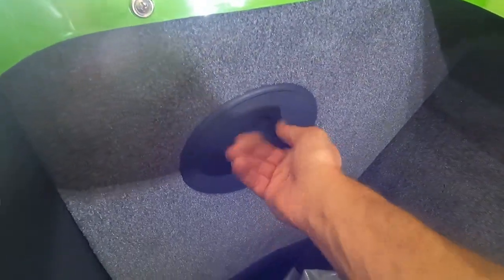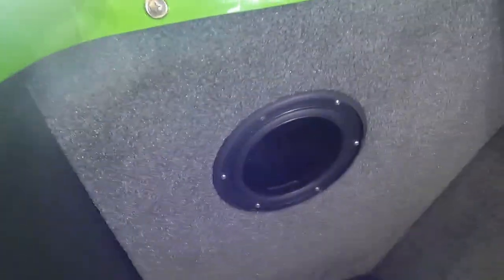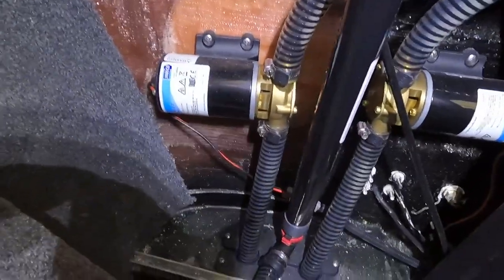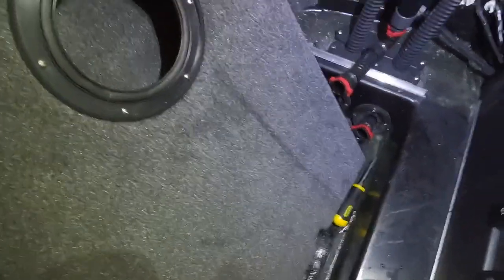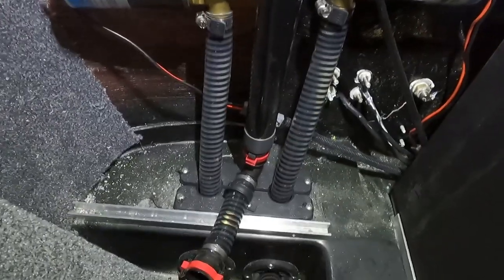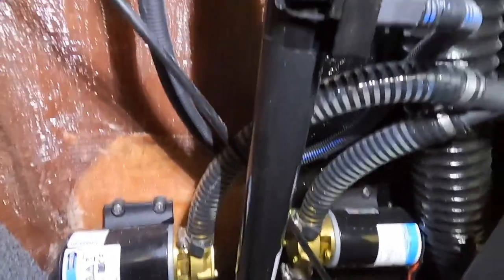They've got overflow vent sensors in these lockers. And that is what is inside right here, that's connected to that vent tube. Here's the other side. I've taken off this rear panel, just a couple of screws at the top and a couple at the bottom. As you can see where that overflow hooks to the bag, and the water will go up this tube past this sensor and then go out this side of the hull through that fitting.